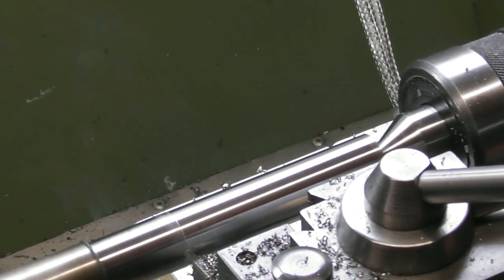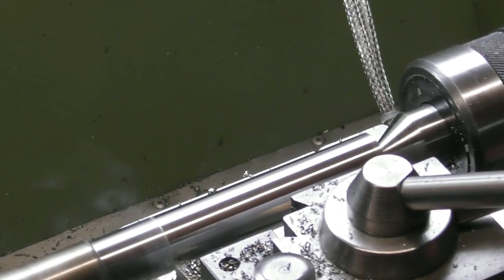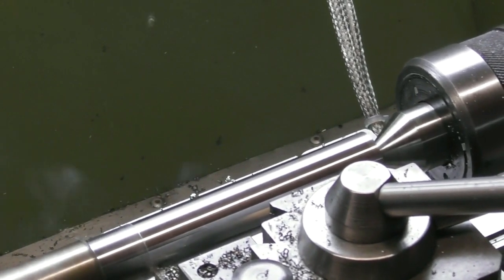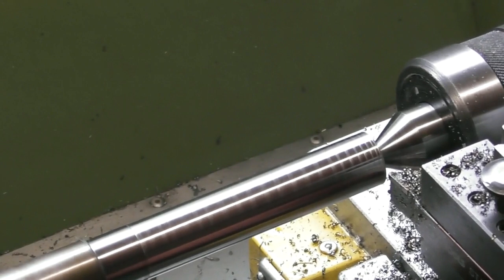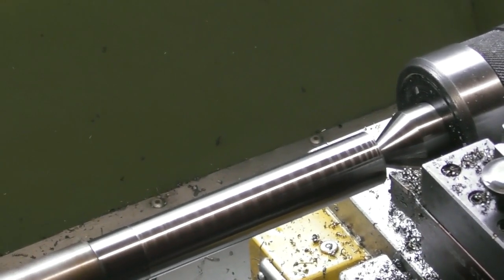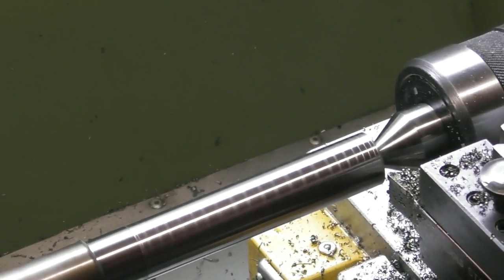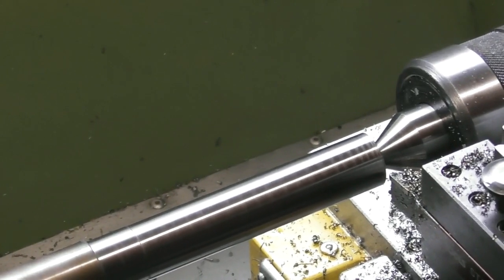I don't know whether you can see, but the finish is, well, it's like a mirror. For this little mini lathe, yeah, that's really quite something. That's out of the ordinary to be cutting that well. So that was a 0.1 cut. I got a bit of springing in there. Let me just set a 0.2 cut. I tell you what, 0.25. And I'll be kind to it. I will give it a bit of lubrication, just in the interest of looking after the tip, really. Because I don't buy these tips, I don't use them enough. So that's half mil off.